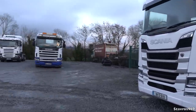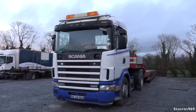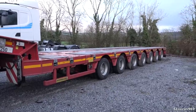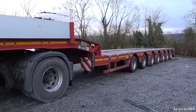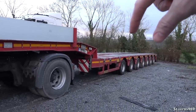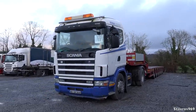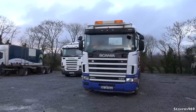The trailer behind is a Scania 124L with 420 horsepower pulling an extendable heavy load trailer with seven axles — 28 wheels at the back. It can extend up to 100 feet and carry up to 90 tonnes. Interestingly, it can be operated remotely: the driver of a following truck can steer this trailer by remote control from their cab, which is very cool when you consider how difficult extended steering-axle trailers can be to manage.